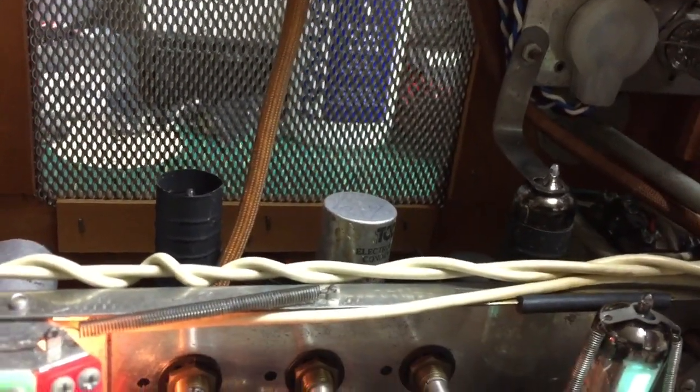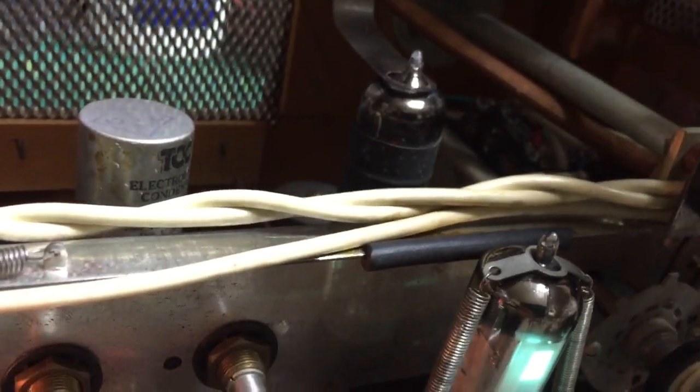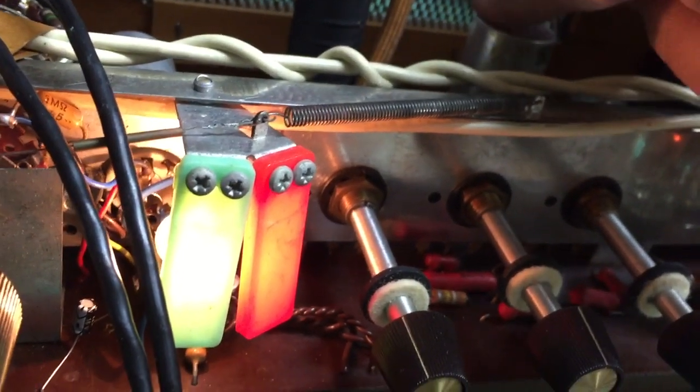You know what, it's okay. It's picking up a bit of heat from the rectifier valve over there, that one there. So it's getting just slightly warm because of the rectifier, the valve. Now that's fine. It's not getting hot. Let's try the amplifier rectifier, smoothing cap rather. Cold as ice. It's fine.